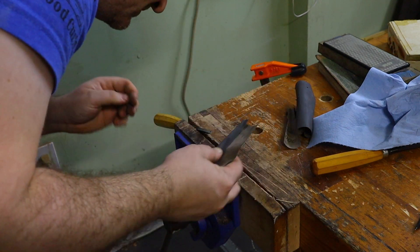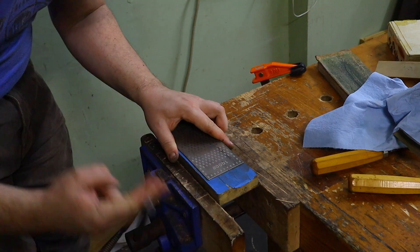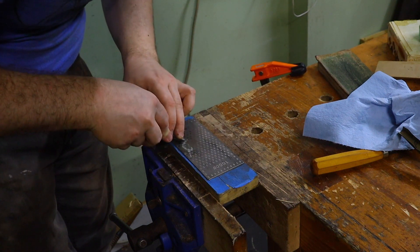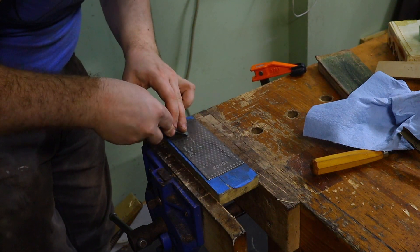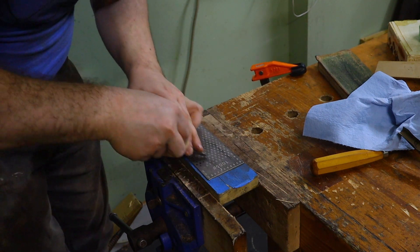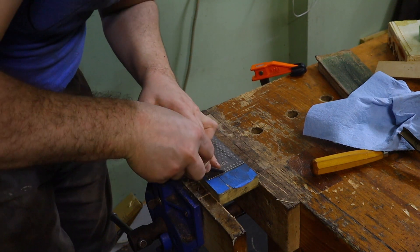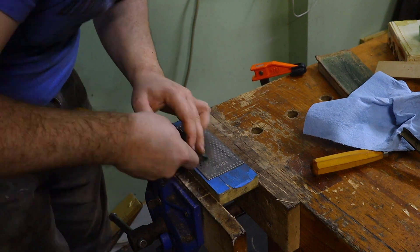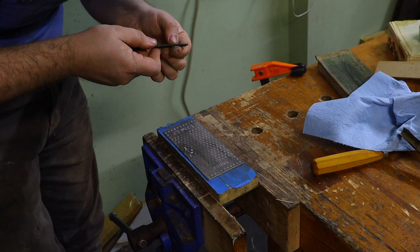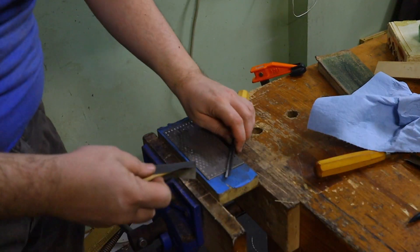Some say that removing the burr this way is wrong and may result in a more brittle edge, but for me it's the only way to ensure that I got to the edge on the finer stone. If there's an old burr, I would have no idea whether I've sharpened to the edge on the finer stone or it's still the old burr. After this small distraction, finer stone sharpening. This was an even faster process as only a tiny amount of metal needs to be removed, and even the fine diamond plate I have is quite aggressive. As soon as I felt burr all around the edge, it took me really a few rounds. So the stone part of the sharpening is done, and if I take care of my gouge, I may not ever need to see that stone again.